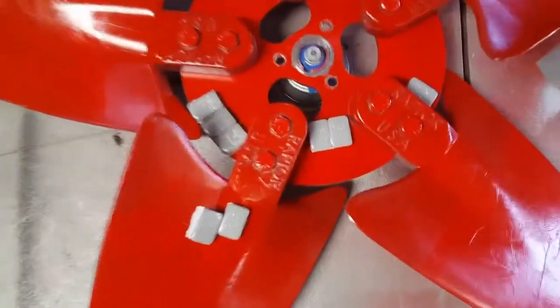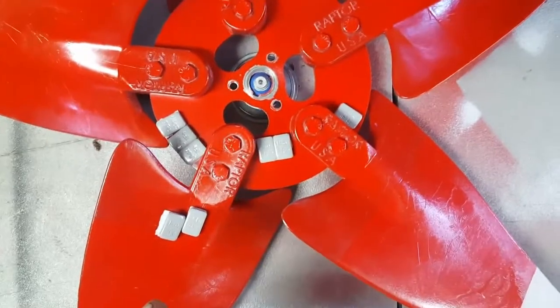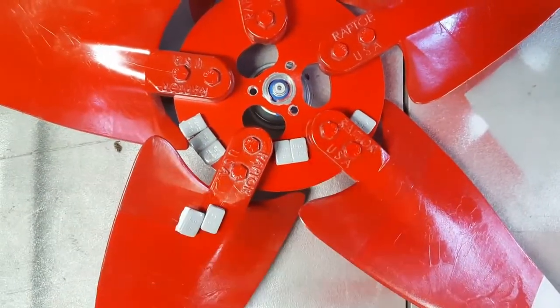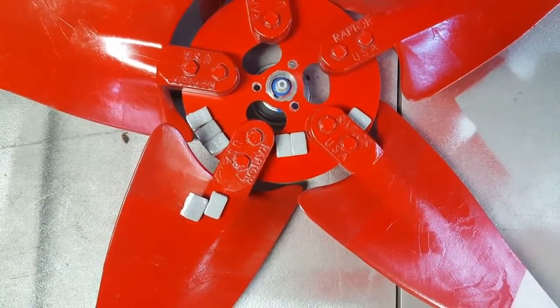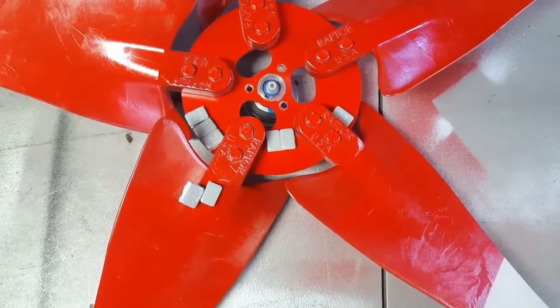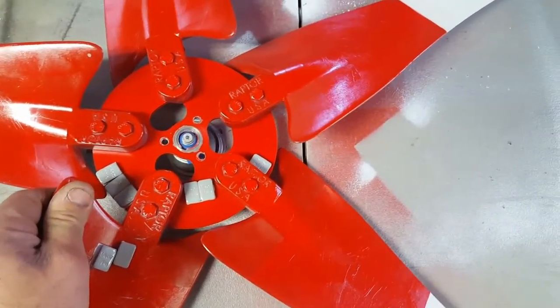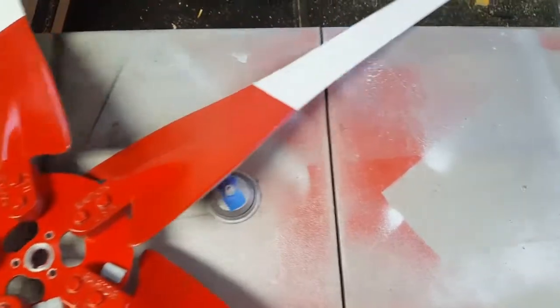Like I said previously, this blade was shaking like crazy up on the roof. Here's why it was so out of balance — all the weight is on this one side. It is very important to balance your blades. I'll carefully move this since I'm done balancing it.